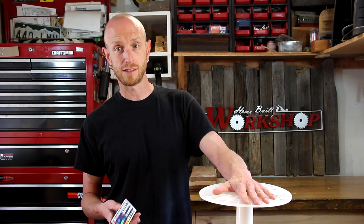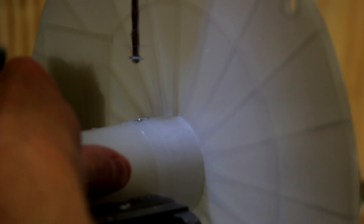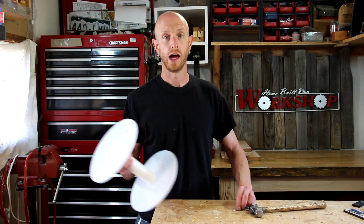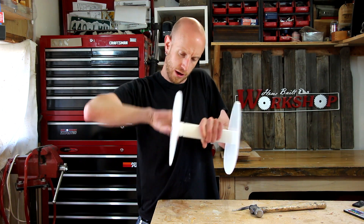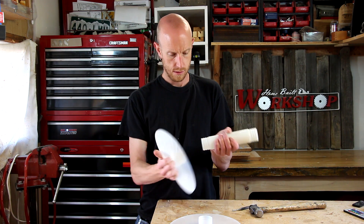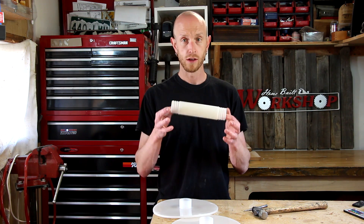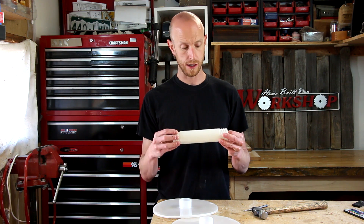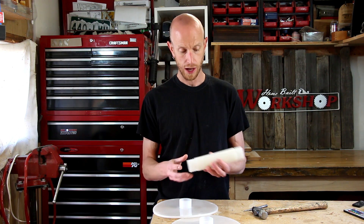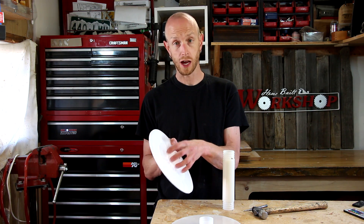Let's get started and disassemble this thing. I'll use my drill press to drill out these rivets — all I want to do is drill the head off each rivet, then take a punch and knock the rest through. With the rivets punched out I can just pull it off. Oh, it threads off — that's cool! That gives me some other ideas for building this. I didn't realize that was the case. Since these ends thread on, I think I'm going to be able to utilize that threaded piece to help hold everything together.